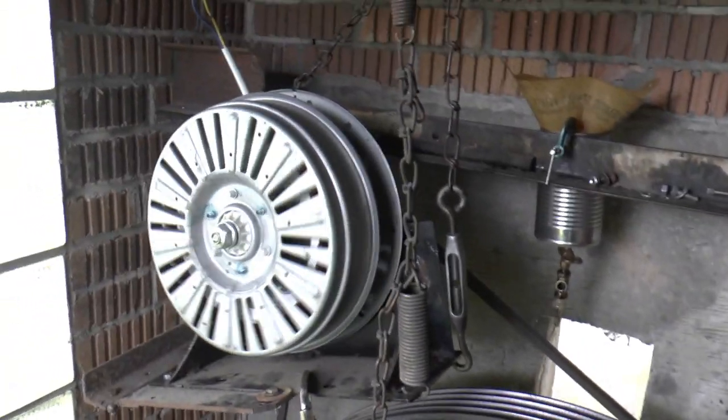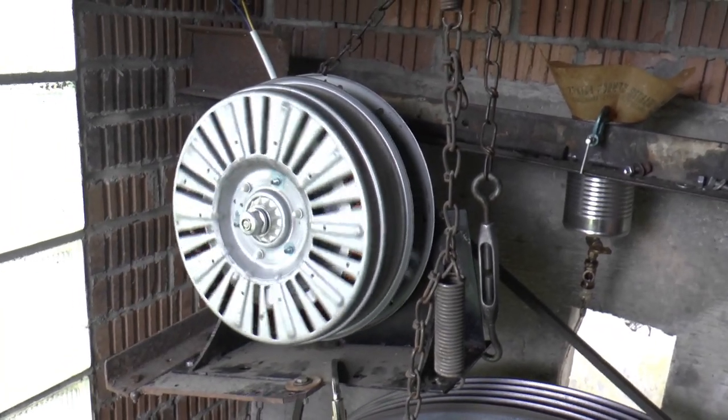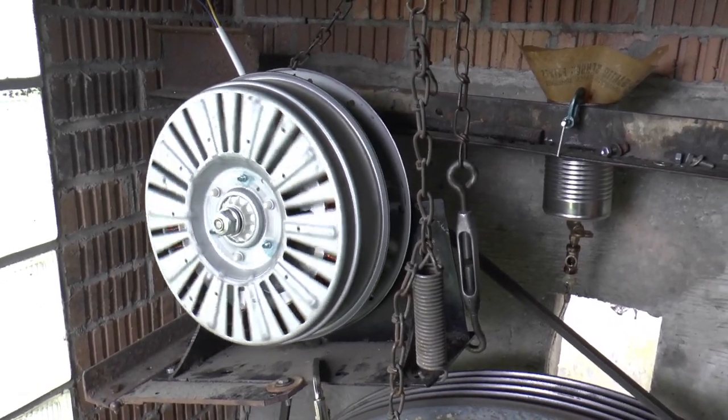And you say I just got this temporary. This is the one with the rewound coils. Took 94 turns off of aluminum and put 150 copper on.